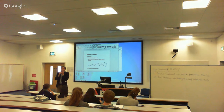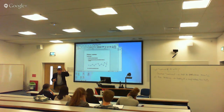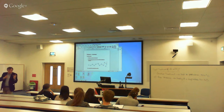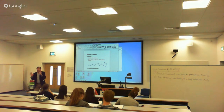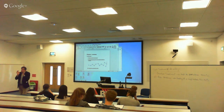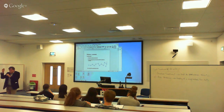One are known as brasses, and we need to know that. What are brasses made of? Copper and zinc. And then bronzes. Bronzes are mainly copper and tin. Although there are some bronzes, for example aluminium bronze, if there are things other than tin, the name suggests it. If you have an aluminium bronze, it means it is copper or bronze with aluminium.